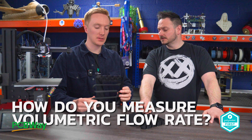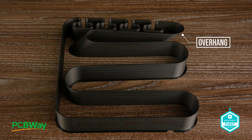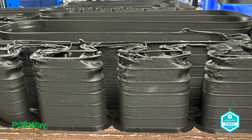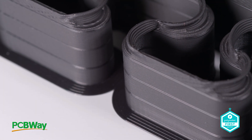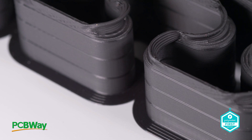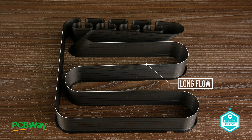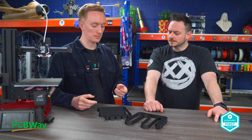How do you measure volumetric flow rate? To get to the final output numbers for a nozzle-material combination, we use these print tests. They have a few features — you have overhangs so you can look at part cooling, and tight curves which also check layer adhesion. If your motion system is zipping around a corner and material isn't coming out molten enough to stick to the layer below, it won't adhere and you'll get a bowing effect. Additionally, there's an extremely long section of continuous track with no sharp moves, meaning your motion system can stay at a constant flow rate — this is how you empty the melt zone of your nozzle to get an accurate measurement.